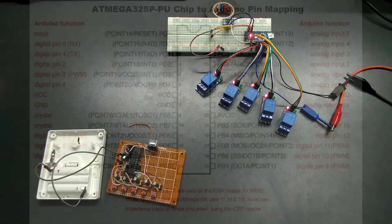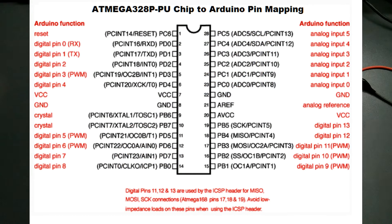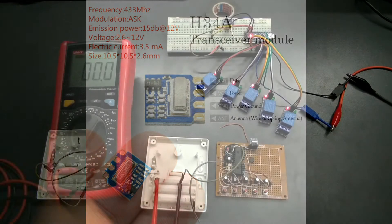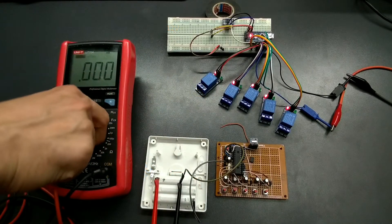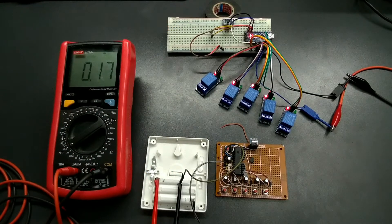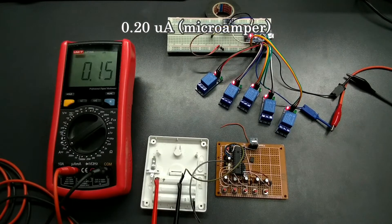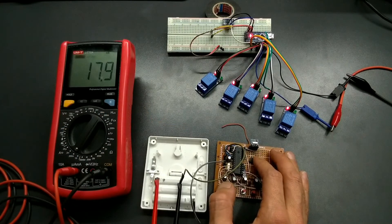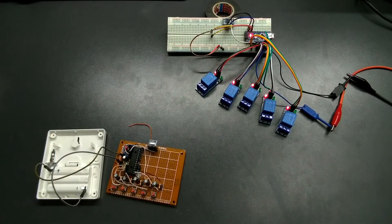Because I want to scale the project in the future, I decided to use for the remote the ATmega 328P with the H34A RF transmitter module on 433 MHz. By disabling the ADC and the BOD module in the low power state of the ATmega, I managed to get the current consumption all the way down to 0.20 µA, and with the LED off, a maximum consumption of 80 mA for almost half a second while transmitting the message, which is extremely important for the AAA batteries powering the remote.